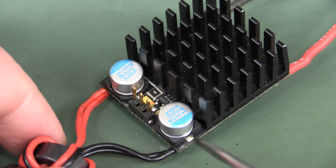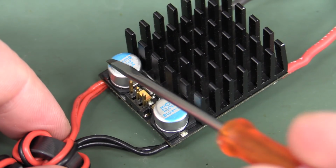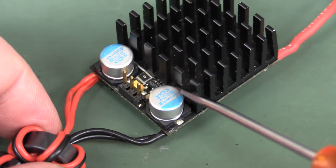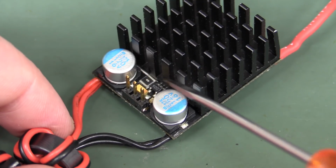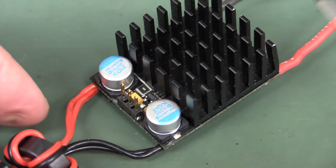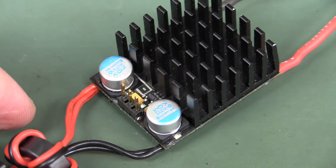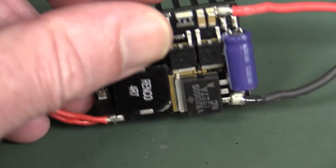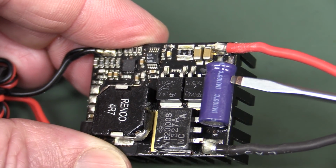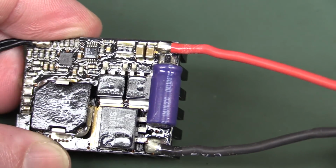Let's go. I'll just mention briefly, though, the capacitors, because these will be a big failure point in these things. If these are wet electrolytic capacitors, then they can dry up over time. And, of course, the ESR increases and their life expectancy goes down. So, pretty terrible. We've got a 105 degrees C rated electro over here. This is on the input.